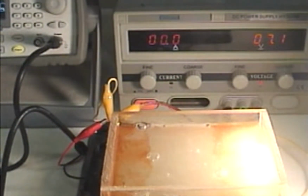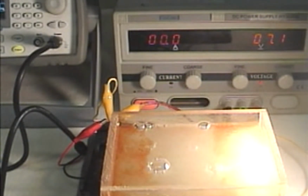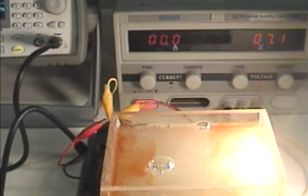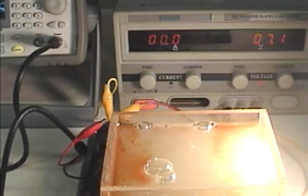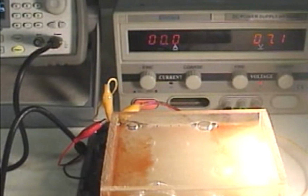I'll pull this up so that the next time the power goes up, you'll see that little knob in the upper left hand corner of the video. I'll take it with my thumb and turn it, and what it does is it literally trims the signal at whatever setting I've got the signal generator on. Right now I've got it set up so that we can trim it at 1/1000th of a hertz. I can toggle it over any direction, and we can trim it at 1/10 of a hertz or a 10,000th of a hertz. Nice little signal generator, a lot of versatility.